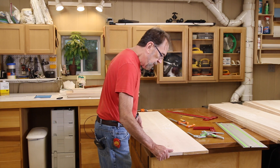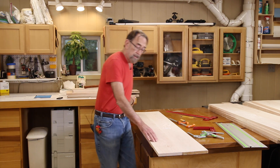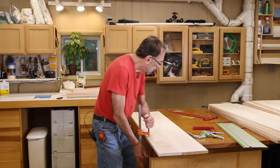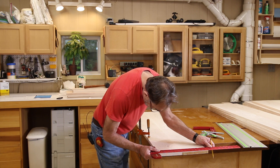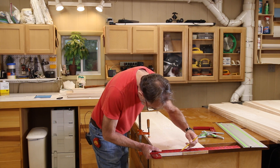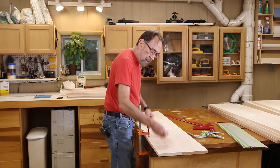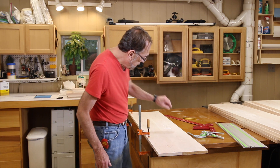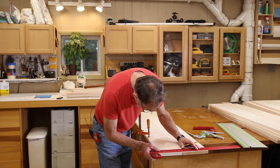Here is shelf B2. I've already determined that this is the end where I want to make my squaring cut, and I'll strike a nice line across here. I need just about as much length as I can get on this one too, because these two are the shortest combinations that I have — they are very much right on the edge. I can actually move that back just a smidge. I'd like to take a little more than less, so I'll cut it right about there.